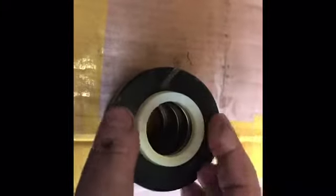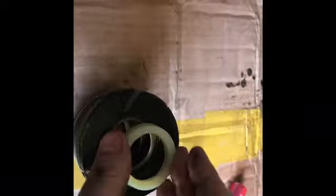And this is important because you can put this in wrong. See that groove right there? That needs to be pointed at the barrel. And the barrel is the black part of your cylinder, which is that right there. That black part is called your barrel. So that needs to be pointed at the barrel. If you put it in upside down like this, then you're going to be wrong. So you put that in, and then this seal, I believe, goes above it. And go ahead and fold that in, and it should snap into place.